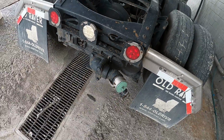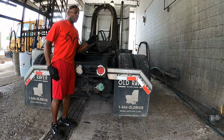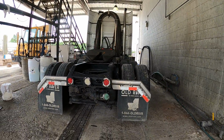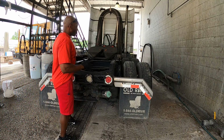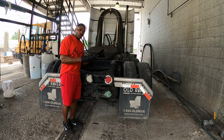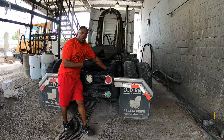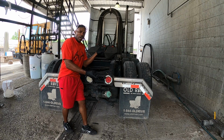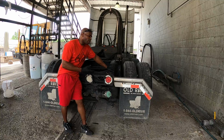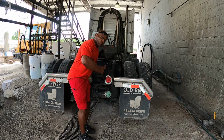And this is my pump. Now this particular pump uses a sliding vane pumping system, which is kind of like sliding vanes using centrifugal force. There are about 3 major pumping systems out there, and don't quote me on this, but this is information from my HVAC school and plumbing school that I had some years ago. You have a sliding vane system, which is called a centrifugal pump. You have a rotary system, which is kind of like a screw system used with liquid displacement. It's called a rotary pumping system. And you also have a displacement pumping system, which is both positive and negative. When the pistons go up, it discharges the liquids, then it sucks down, and discharges, sucks down. I don't know if that would be considered diaphragms, I don't remember exactly. But this one here is a centrifugal pump, which is using centrifugal force.